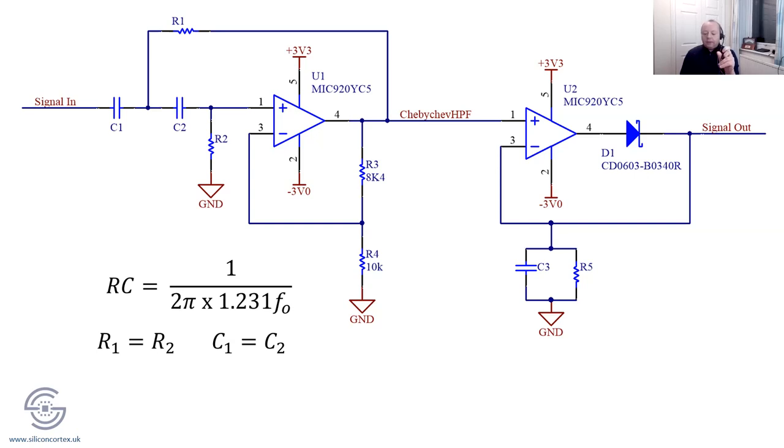In the good old days of radio with AM, we had the carrier frequency and then amplitude modulation, if anyone remembers that. And you just use something like this to pick off the amplitude of the signal. This is just a little bit of smoothing, so that when you go into the ADC you don't end up with a sampling problem. I guarantee that would work. This is a two-pole filter.